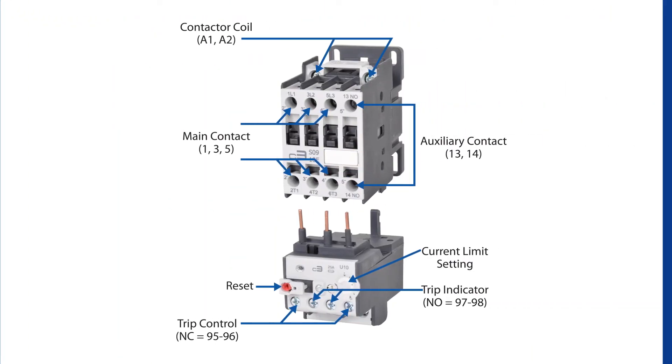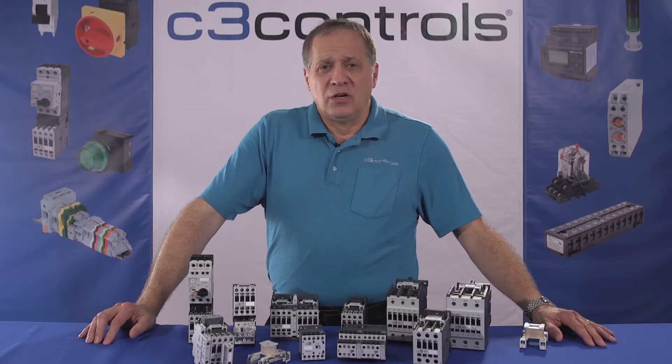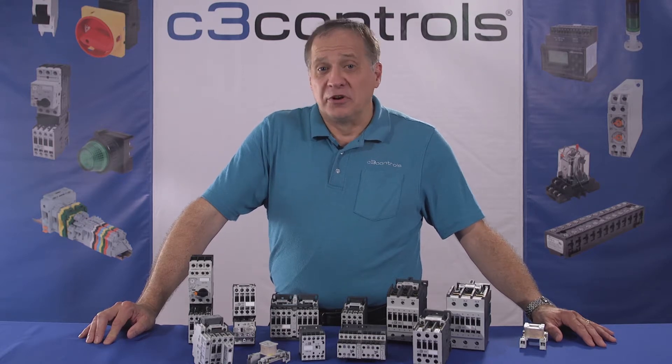Here is an example of the typical components of an IEC contactor and thermal overload. Contactors are often used to provide central control of large lighting installations such as an office building or a retail building. To reduce power consumption in the contactor coils, latching contactors are used, which have two operating coils. One coil, momentarily energized, closes the power circuit contacts, which are then mechanically held closed. The second coil opens the contacts.